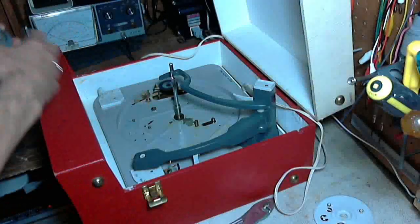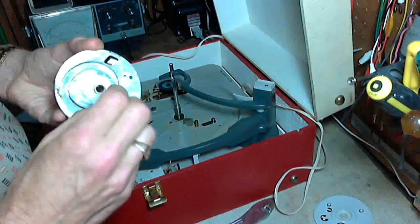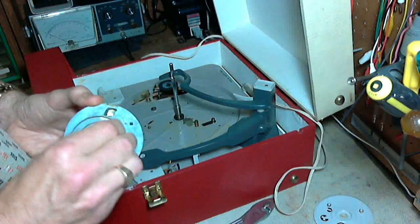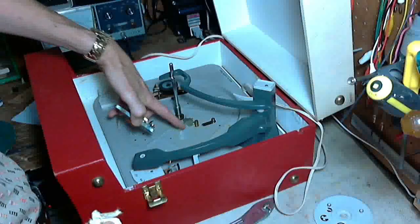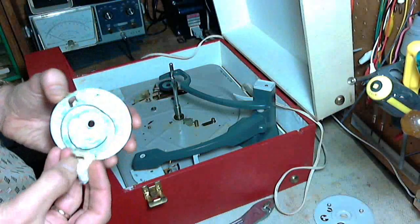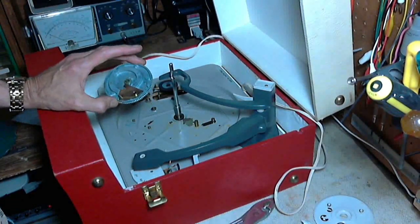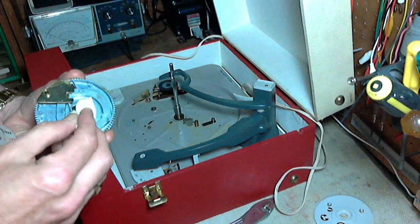Now clean out the old stuff. Some of these are so stuck on their shaft that if you try to turn them, you'll start turning the shaft which isn't supposed to turn. You'll loosen the shaft and get the false impression it's turning on the shaft when in fact it's still stuck. I've had one of these I worked on for like half an hour — and the secret in the end was heating it up quite a bit with a blowtorch.